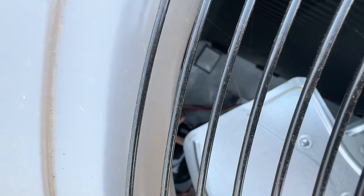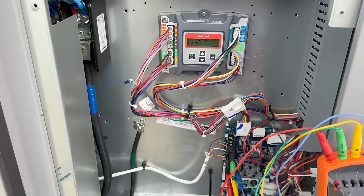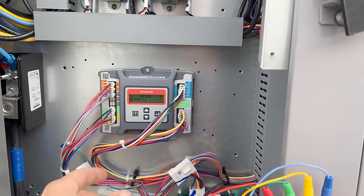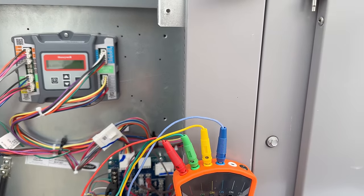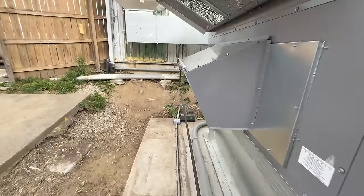What is that down there? That looks like a rating plate — oh, that fell off the compressor down there. Did they drop this thing off the semi? So it is 60 degrees outside, which is perfect because we're able to test out the Jade controller. 63 degrees was my switchover point, so it is actually economizing, and I just pushed it into stage two. They just used dry bulb sensors on this, which is why I couldn't find my enthalpy control.